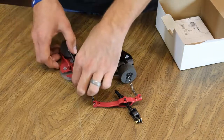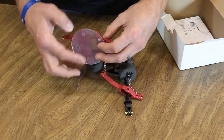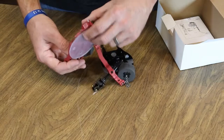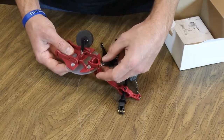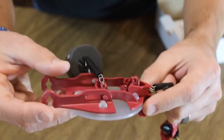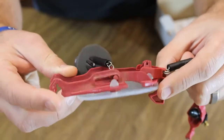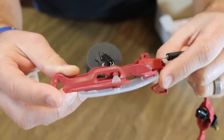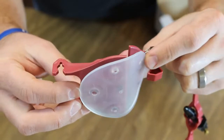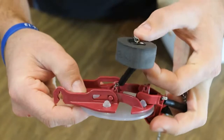Most flappers are made of rubber and have a cone on the bottom which holds air and helps them drop at a delay. I'll show you a close-up — this is actually a plastic flapper with a hinged assembly in it. It's flat silicone on the bottom. Both flappers are built that way, with a float attached to help them stay up longer.